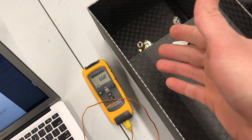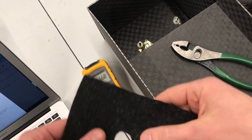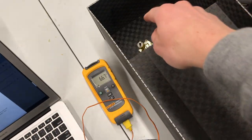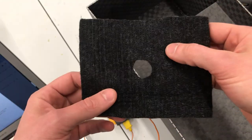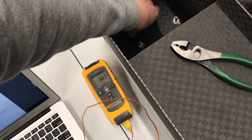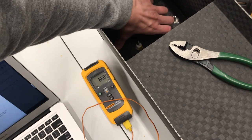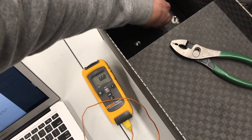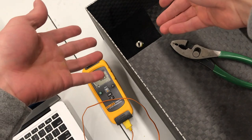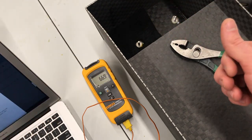I'm just about ready to get started. One thing I want to mention before I get going is that I'm going to be protecting the surrounding composite with this fireproof blanket. We'll do that by nesting it on top of our setup, so that as we heat it up we aren't going to damage anything around the stud.